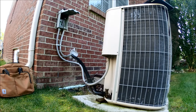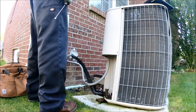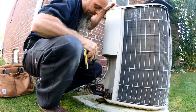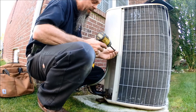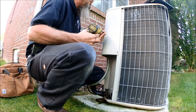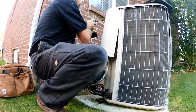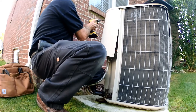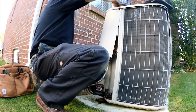We're out at the condensing unit here. The main call was for water leaking, but I know it's got plenty of refrigerant in there — my line is sweating already. Coil is cold all the way up.